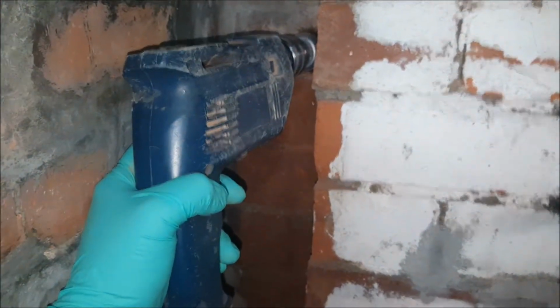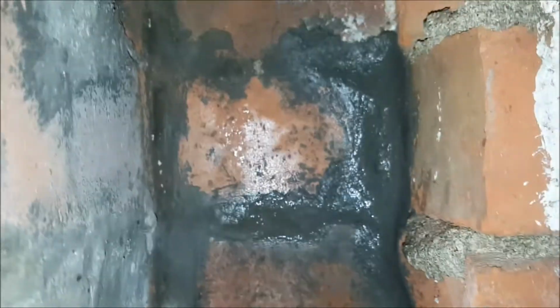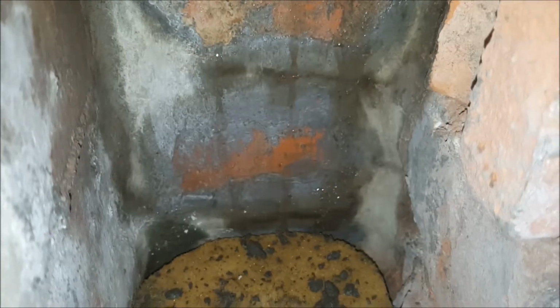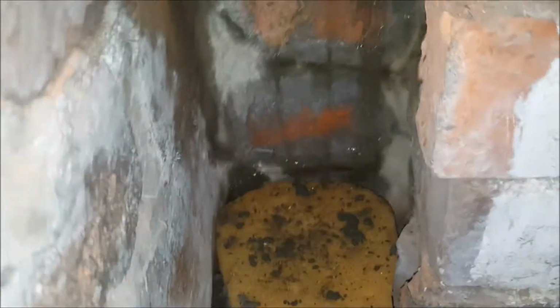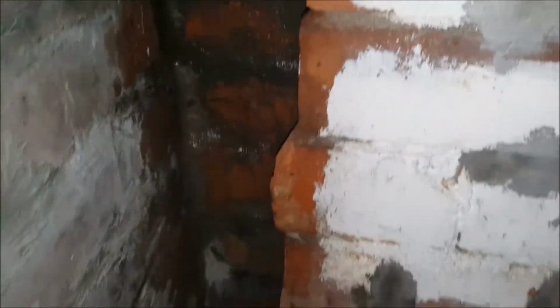Yeah, that's why it's jumping around, because I'm using the other hand to videotape. We've patched up the last bit, as you can see. The sponge is to catch some of the runoff. It's looking good. No holes, not many gaps. At the moment we're still keeping it wet, just to make sure that the concrete sits well.